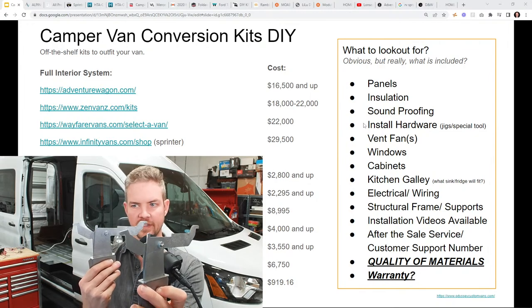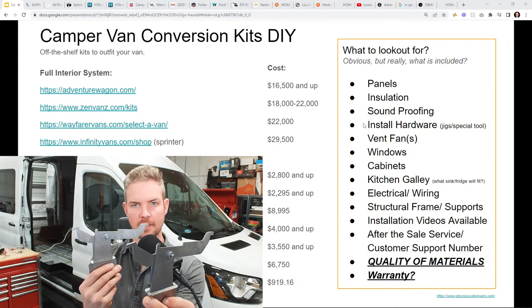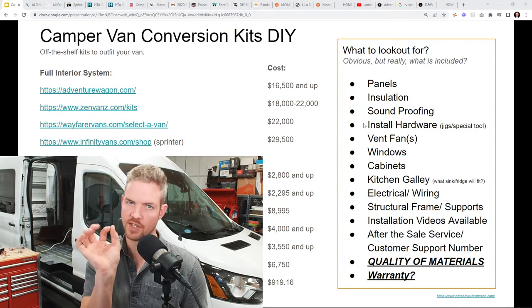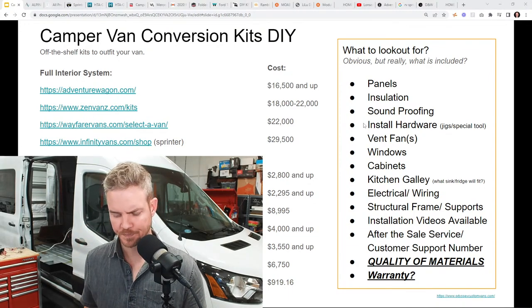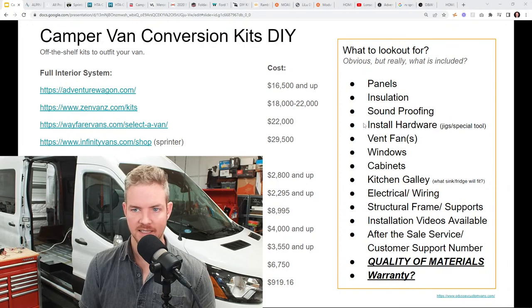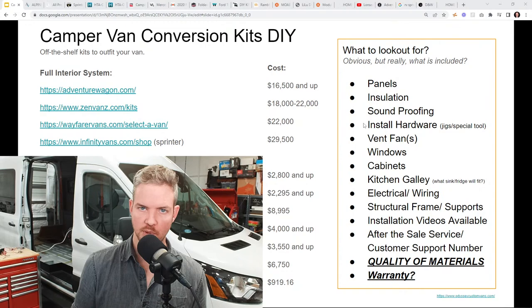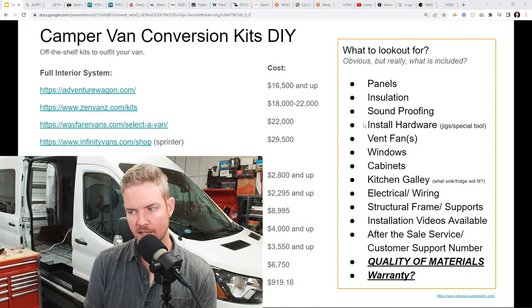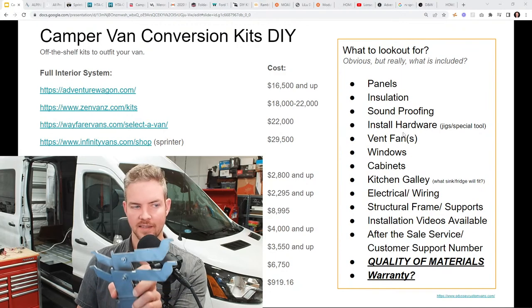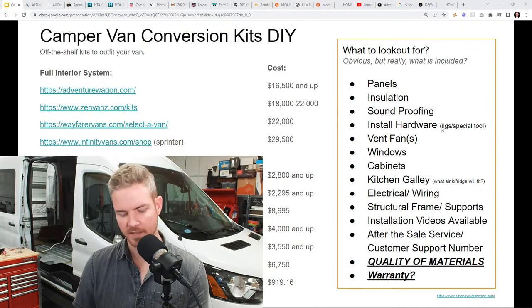And this would hold the A-frame beam in place so that you could precisely rivet it where it needs to go. And when I mean precisely, a 16th of an inch off is probably okay, but an 1/8 of an inch off, you're really pushing it as far as how everything fits together. So having an installation hardware like this, this would be considered a jig or a special tool.